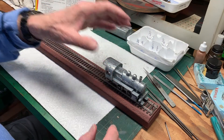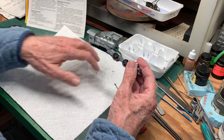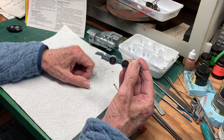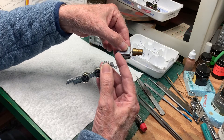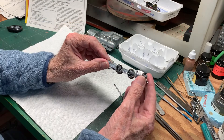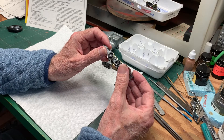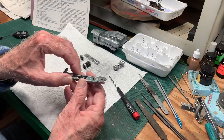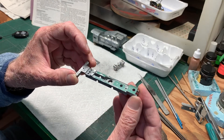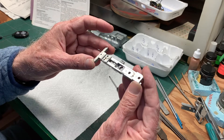As far as I can tell there's no impediment to the rolling on the axle, so looks like we got this one ready to go to the next step. I think it's time to disassemble all this and take the frame down to the shop and file off this protrusion here that needs to come off for the new motor to go on. The new motor has its own sloping fixture to get the angle right so it doesn't need the cast-on one. Off to the garage with a vice and some big files to do some serious filing, and that'll be that. Now here we are back from the shop with that motor mount protrusion all filed off.